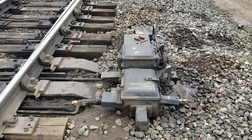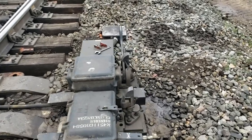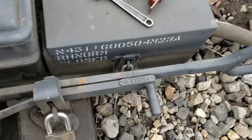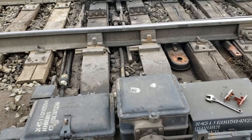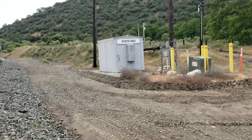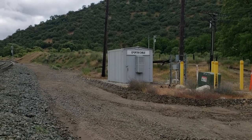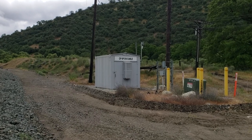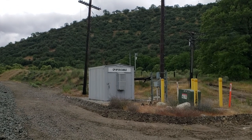Let's start with the basics — the mechanical end of things. This is a power switch machine. That lever right there where it says 'motor' means that right now this is in motor control, which means it is being operated remotely. The wires tie into that junction box and go underground over to that house. I can go in there and take this location into local control and throw the switch. The dispatcher has control of it and they operate the switch based on where they want to put trains, what track they want to run them on.